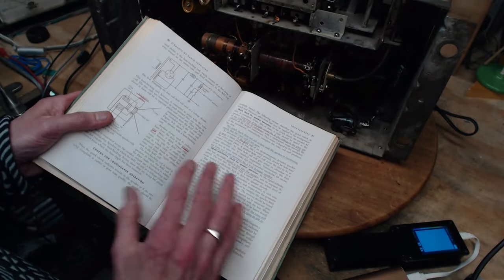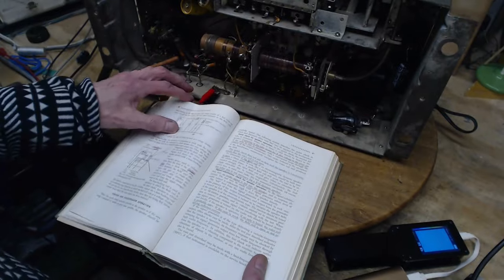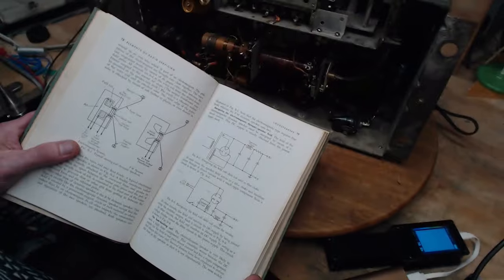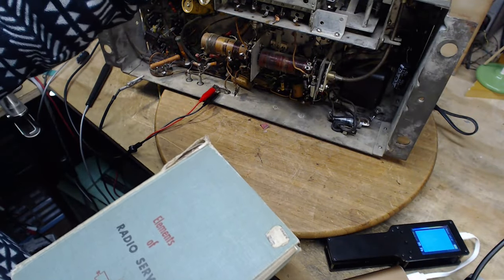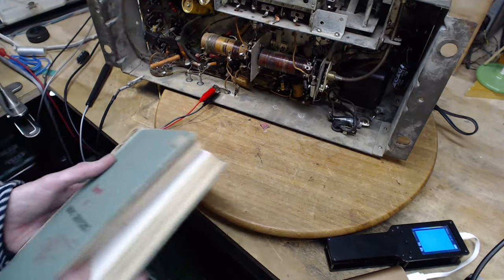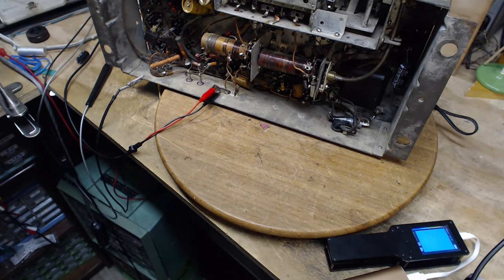Well, at the highest level, the speaker's not intended for the kind of use I'm trying to put it to. That's a pretty high level. Probably, if this radio were looking for, what was it, 2,000 ohms on that? It was 1,700, 1,800 ohm. If this was looking for an 1,800 ohm field coil, this thing would have worked out just fine. What am I going to do now?